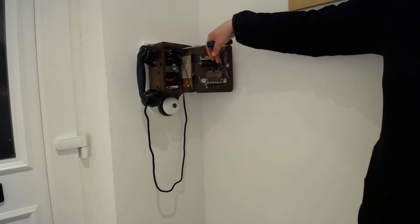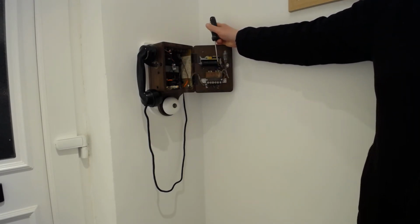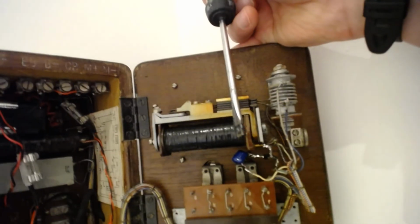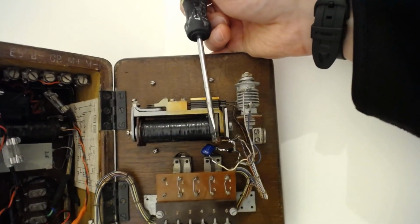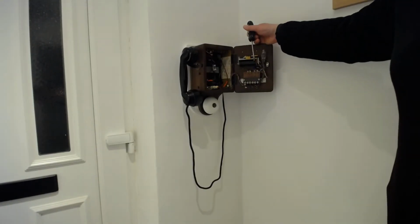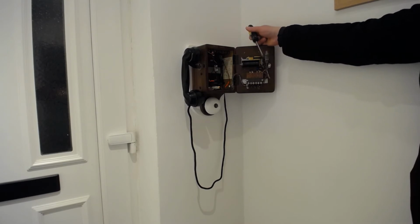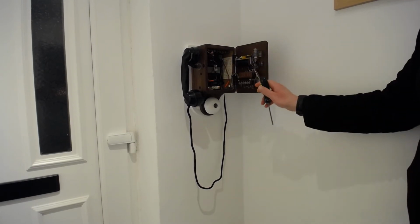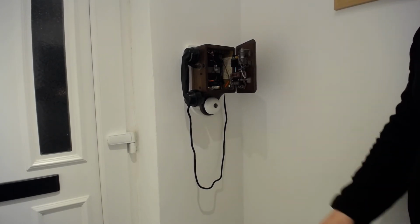So there's a little bit of modern wiring in here. If I point to it with a screwdriver, it's a beautiful thing. I'll get some close-up shots in a minute, but there's some wiring in here. If I bring that up, so you can see here, you've actually got a little rectifier circuit, and what that is doing is taking in the 48 volt AC and converting it to about 15 volt DC, through a capacitive dropper effectively. So that's how that bit works. That's fairly simple. The rest of the wiring for that though is untouched, and when I was experimenting with it, even without that little circuit, it was working. The problem was though, I was giving it an awful lot of voltage, and frankly I probably would have burnt the thing out before awfully long. So that is a much happier system now.